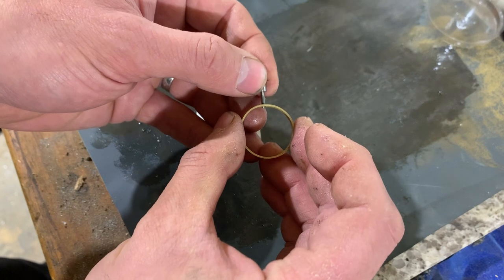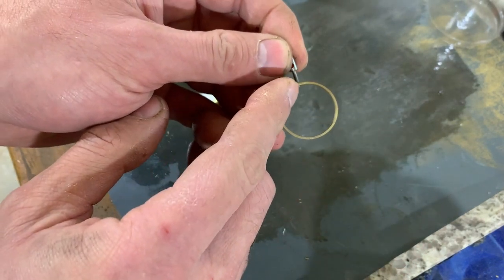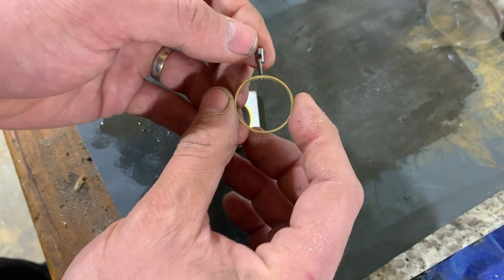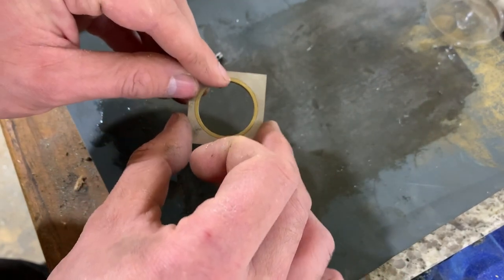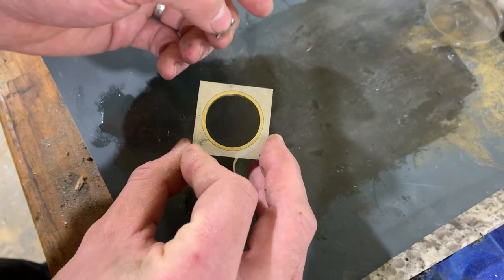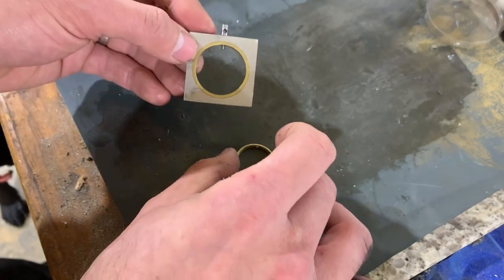That's not quite a press fit. It is if I push it back further. But the end, I sort of rolled it over with the file, so it sticks out a little bit. I'm not too worried about that, but I think I can remake this pin piece, and definitely if I remake this with this section over here being shorter on the aluminium, the pin's going to need to be shorter as well, which means less deflection and hopefully a better tolerance on that fit.